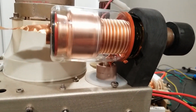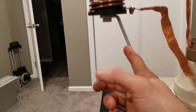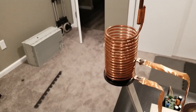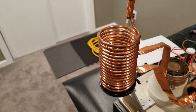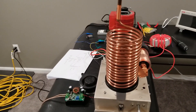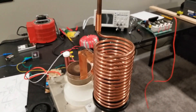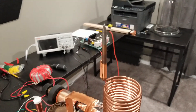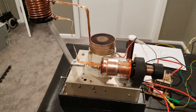I'll just have the feedback connection connected directly to the feedback capacitor. I fabricated this bracket and mount for the resonator coil that I wound out of copper tube — no real specification, just about 16 turns, which came out to about 8 microhenries of inductance. The breakout point is just a sharpened piece of metal.